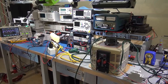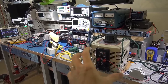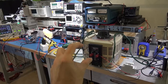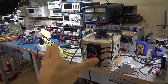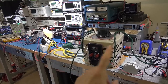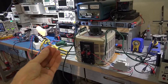As we get ready for the AC test, let me explain the setup. I've got a variac so I can vary the voltage — ultimately it's there for safety, allowing me to do testing at a low voltage rather than 120 volts. I want to warn you: I wouldn't recommend doing this at home, it can be very dangerous. I've taken as many precautions as possible, but there's still risk. I've got several earth leakage devices — one there and one under the desk — so if I became part of the circuit they should kick in, and I've tested them and they do work.